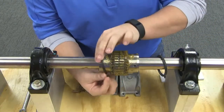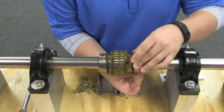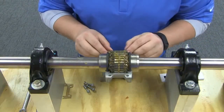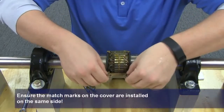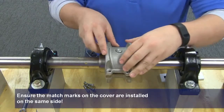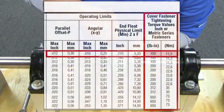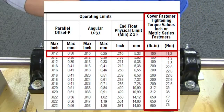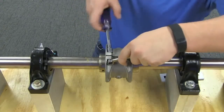Position the seals on the hub to line up with the grooves of the cover. Position the gaskets on the flange of the lower cover half and assemble the covers so that the match marks are on the same side. Push the gaskets in until they stop against the seals and secure the cover halves with fasteners, tightening to the torque ratings specified in the table. Make sure the gaskets stay in position during tightening of the fasteners.